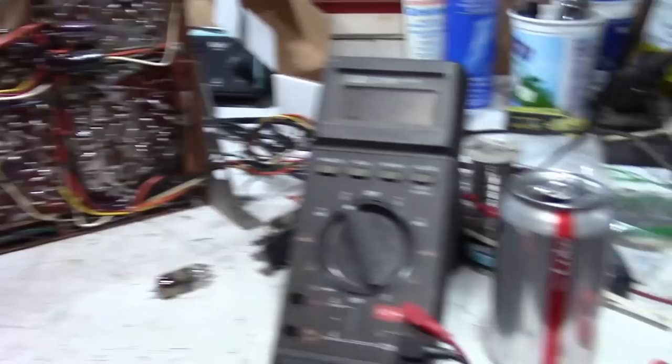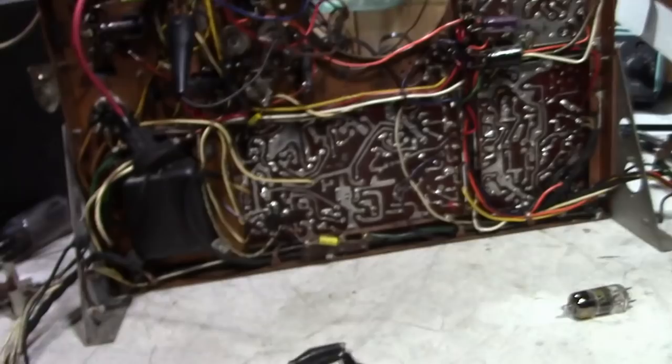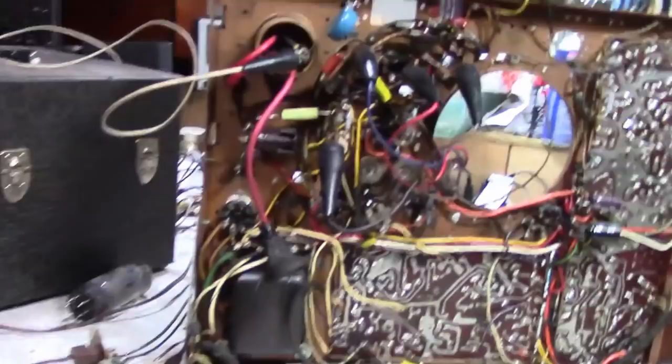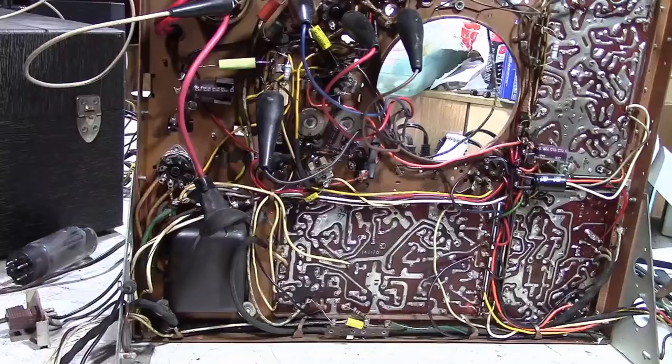Going all the way back to the power supply — the highest potential should be 265, but looking at the SAMs it should actually be 290. Not surprisingly, all the other things — the 280-volt source, the 155 source — everything is about 20 volts too low. And that's with my variac set for about 117 volts, which is what the schematic specifies. It's a little low, but the set should still work fairly well. All the filament voltages are dead on. I did swap out the 5U4 thinking that might be a little weak, but it's still within about 10%.